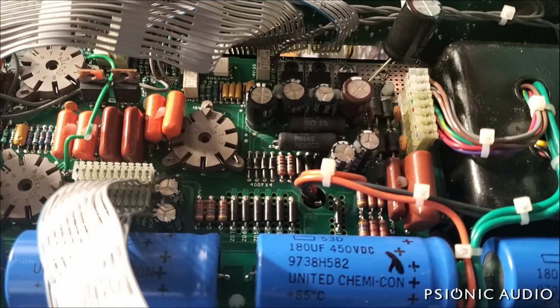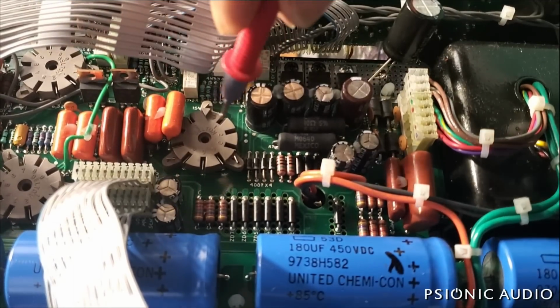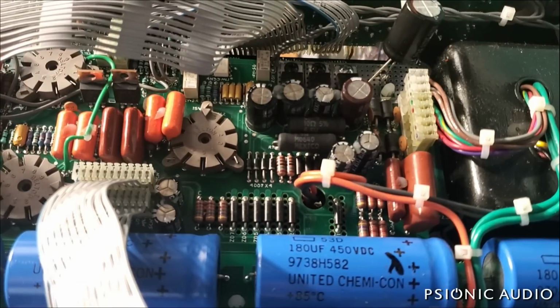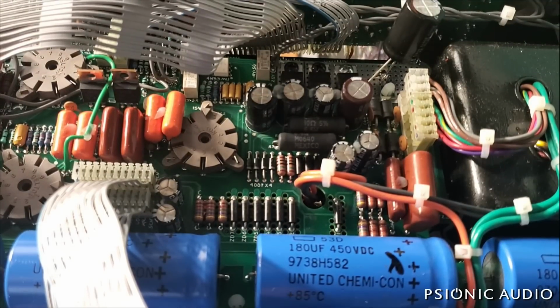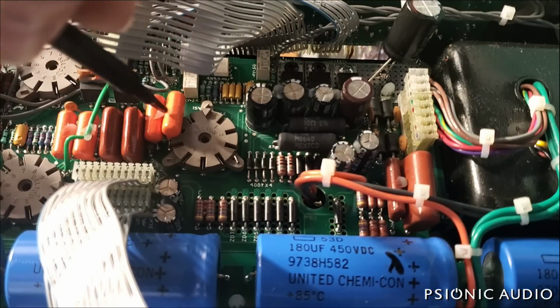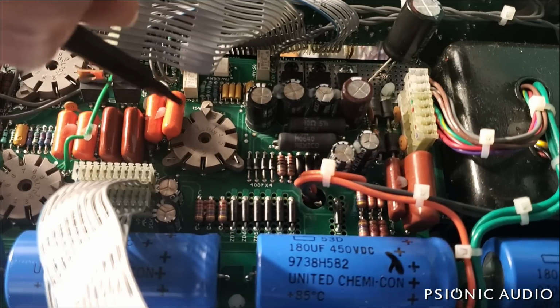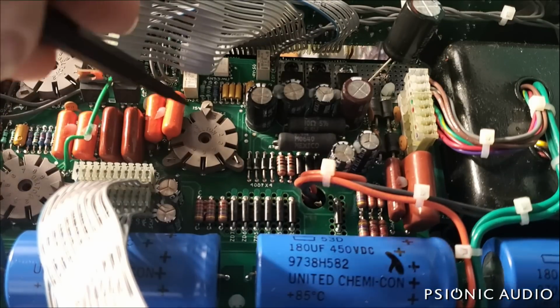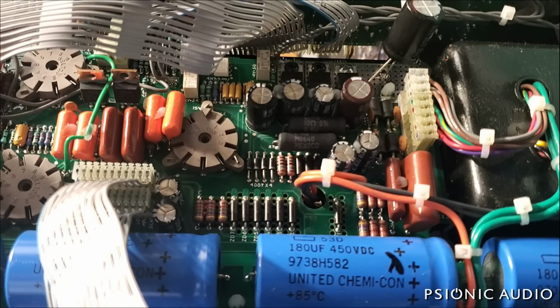That shows that's the right pin. Shows no voltage there, so that's as it should be. That's at 0 voltage, and the cathode is actually much lower in reference. It's an odd circuit, but I suspect it might be this capacitor. And as these two capacitors are inexpensive and more easily accessed than a lot of the other stuff in the amp, let me do a Hail Mary and try those.